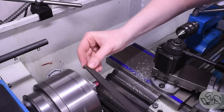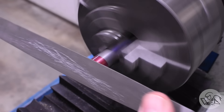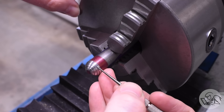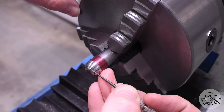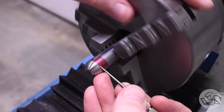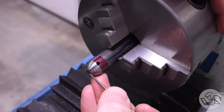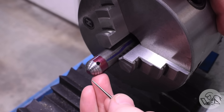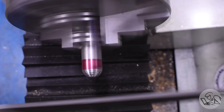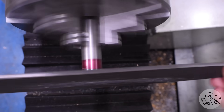But what's the big deal? Every machinist knows you can file round things on the lathe. Well, remember — this is about making accurate curves. The trick is that the step turning and the Sharpie marks give you a topographical map of where to focus your filing. You can tell visually from the thickness of the lines where you need to spend more time filing. The bottom line is thicker than the other two, so I need to focus more filing there. Furthermore, the red at the top gives us our reference for the top of the curve. When that Sharpie mark has been filed back to the center line of that reference hole, then I know the top is complete. And on the end, when the red is down to a single dot, then I know the end of the curve is correct. Those little visual cues while you're filing make all the difference in the world. I am not a skilled filer by any means, but even I can make an accurate curve with very little difficulty just with those visual cues.